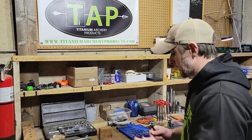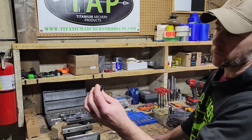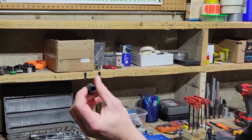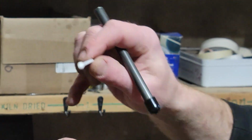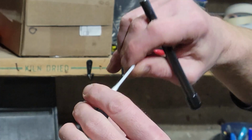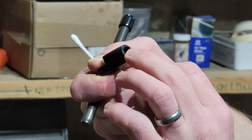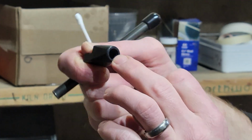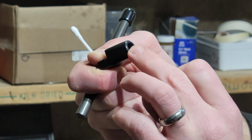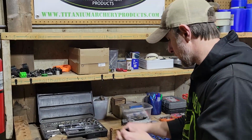So the part, I cleaned it out, and that's important. You're going to want to do that. So the inside of it is relatively cleaned out at this point. I cleaned it with acetone. So I recommend you use a Q-tip and put acetone on there, clean the inside. You can also see a little bit on the outside here, some residue from when they applied the epoxy. And it was a little bit sloppy. So that's actually bonded onto the brim. Not really a problem though, but you can see that is there. So it's cleaned out, it's cooled down.